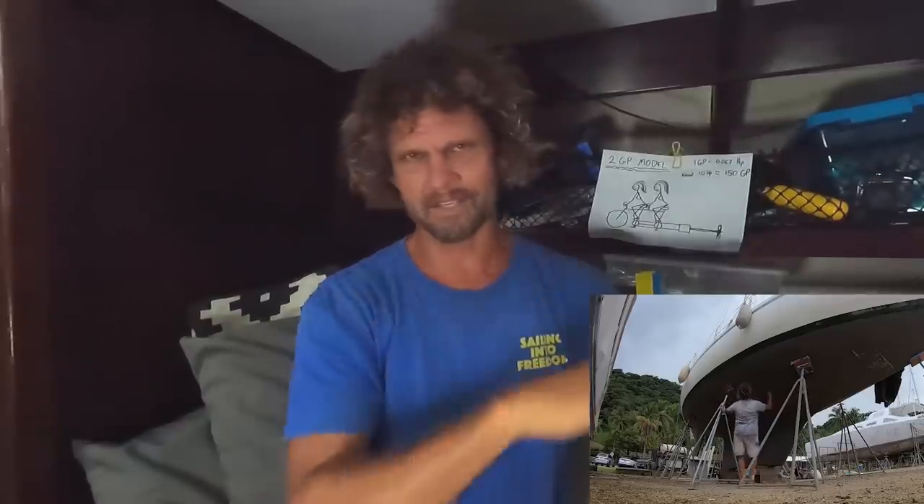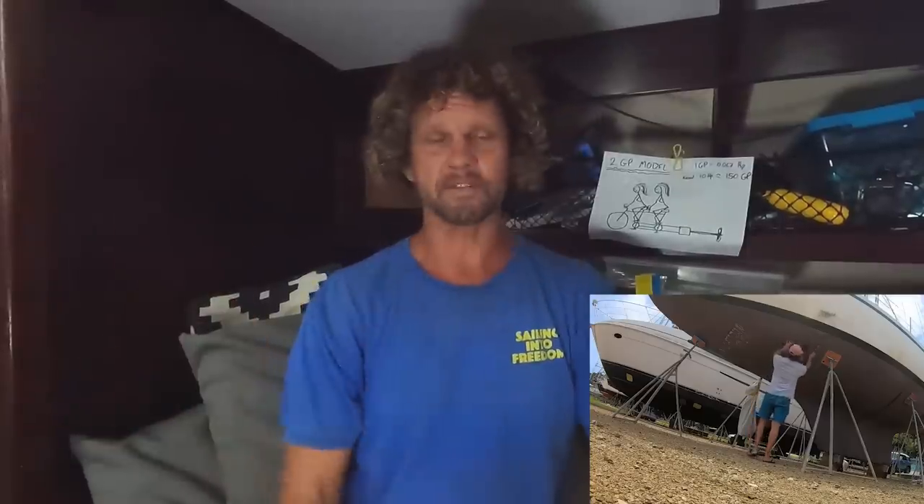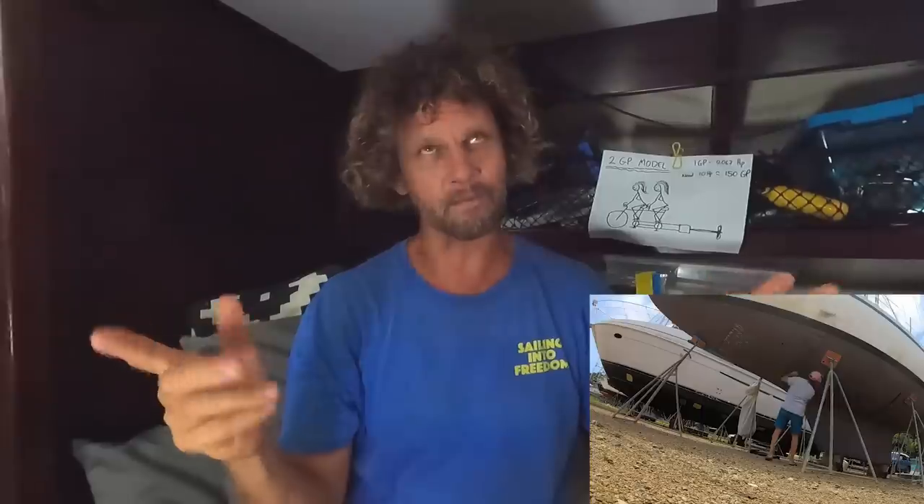So I'm tapping out the hull. I've got it all on film — both head perspective and ground perspective — but it's a bit boring so I've cut it short. I've got no special hammer, just an ordinary one; you're supposed to have a special plastic hammer but this is good enough. I'm listening for crispness: a nice sharp crack is good. If it goes to a dull thud, then we've got problems — either delamination or something else. I've been thinking about this for three or four months since I had the problem, and they say when you start thinking too much you overthink things.